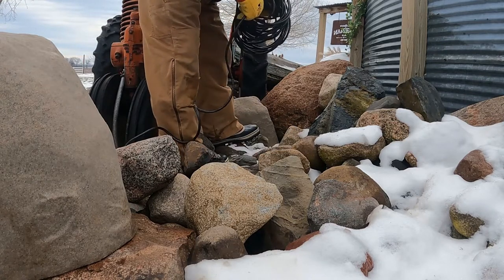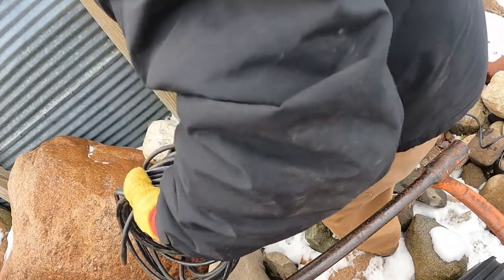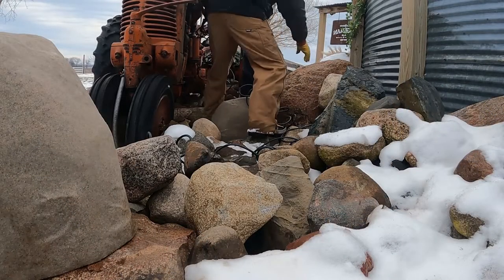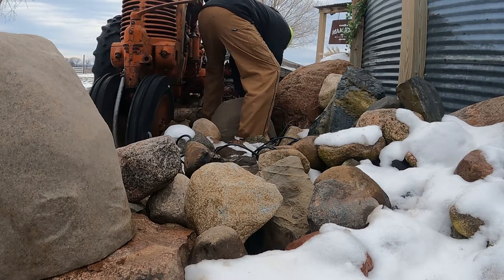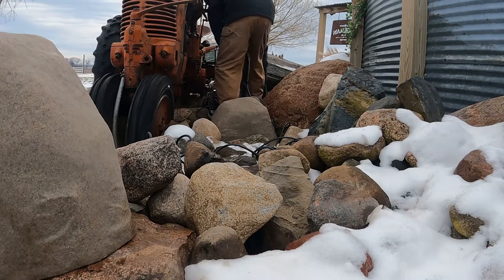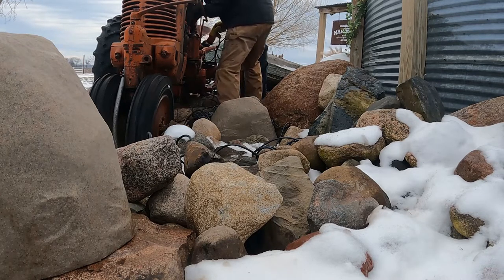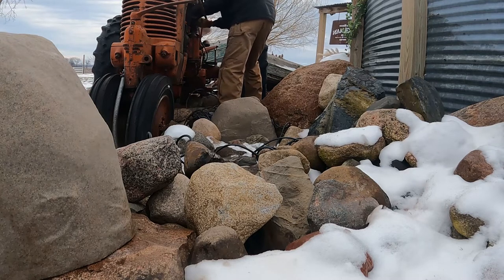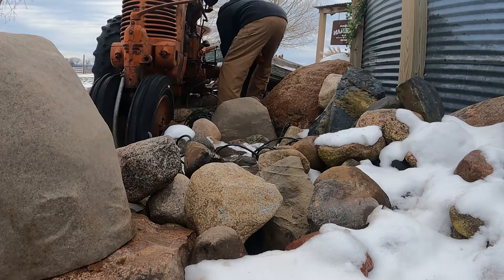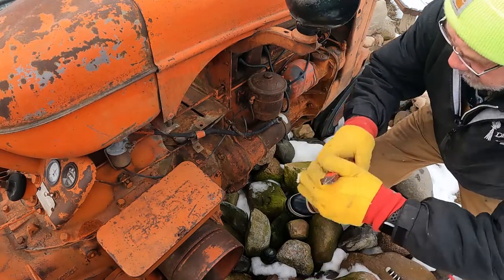I use this heavier covered electrical cord because I want to protect it from the rocks. I obviously don't need anything anywhere near this heavy for what we're doing, but I want to use it just to protect it from the rocks rubbing. We're gonna leave a little slack — the pump is underneath this rock here. Then we're gonna run up something like this and come back before we go up. I think I'll have the junction up underneath the hood. The water kind of drips down and I'm not gonna cover this up right now — I'll wait till next spring when I can move the rocks. I'm gonna clip that cord and our junction will be here.